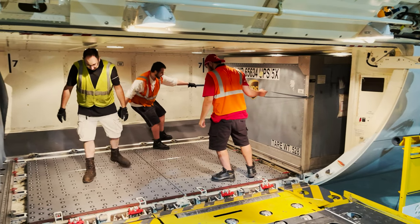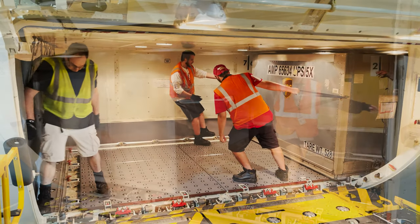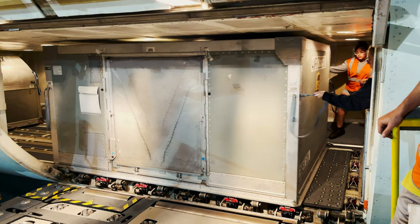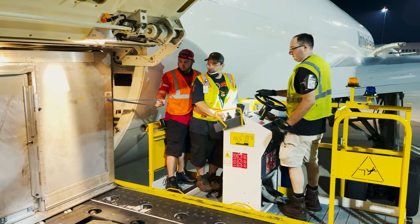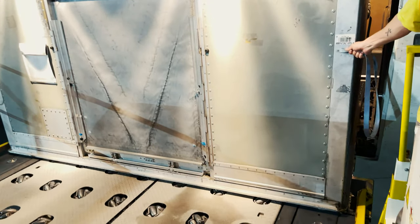Move the ULDs out of position with a smooth and steady motion. Remember, ULDs in the front P-section are rolling downward with the slope of the ramp. Stay in control or get out of the way. If you have to step back onto the K-loader, be sure to step into the safety zone before the ULD passes onto the bridge. Beware of worker congestion and don't hesitate to communicate.